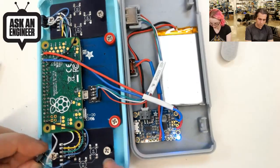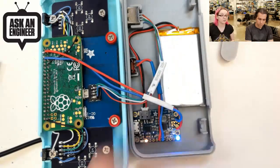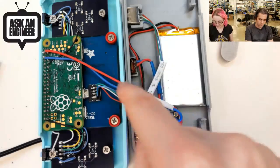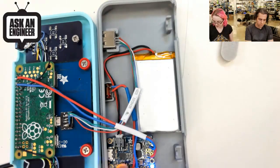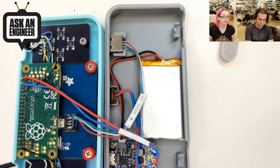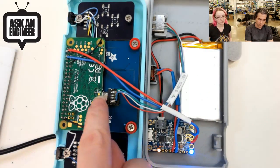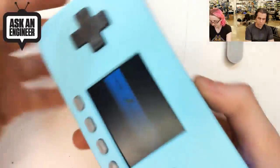You get, hold on, this button came loose. You get 2 of these button boards. So the wiring is pretty easy because you can solder the buttons directly onto here, and then we also get some silicone wire that's really handy for making all these power connections. A power boost for powering off a battery. You can recharge it and take it on the go. A USB jack, so if you want to connect an external USB Wi-Fi adapter, for example, to download games or install content or update it. And a little micro on-the-go adapter. So this is a really cute little gaming platform.